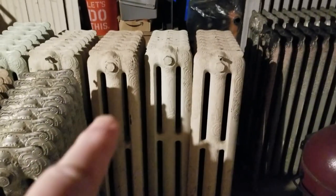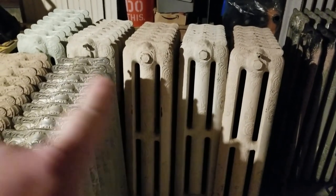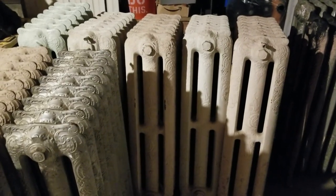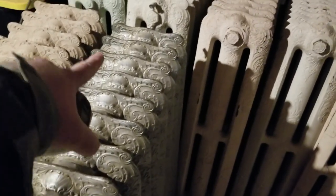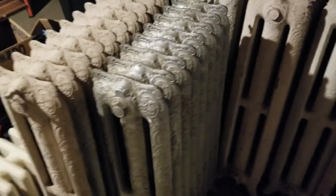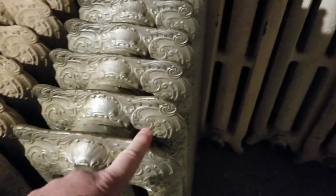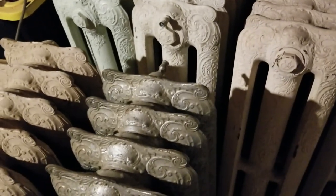The first thing you do is measure whatever radiators you have. These sets right here are actually two separate radiators, not four — you can see the variation in the color and the paint. What you do is measure across the back of the radiator at the top: measure the width and then measure the height including the legs, and write that down. You can also count the individual ribs and get a calculation that way — I'll show you both methods.